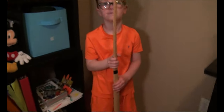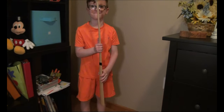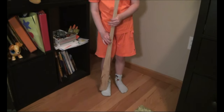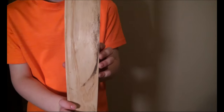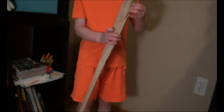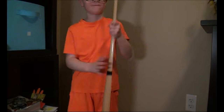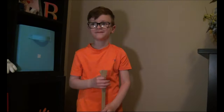The bat Blake is holding is just a standard wooden bat — a Rawlings bat, well now it's half of one. We bought a wooden bat and cut it in half with a circular saw. We mounted it in a vise in the garage, cut halfway on one side, flipped it around, clamped it in the vise, and cut the rest of the way. We're actually getting two hat holders out of one bat — one for Blake's room and one for Kobe's room.